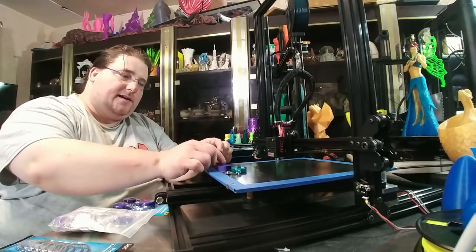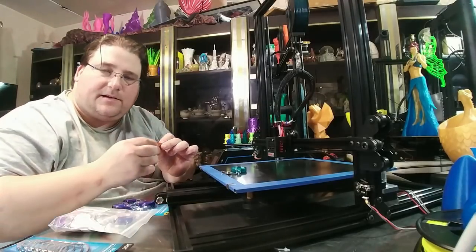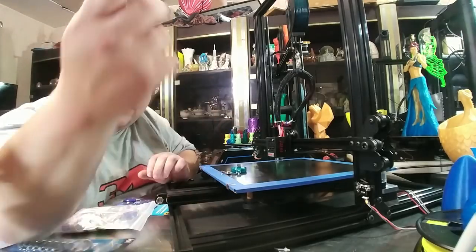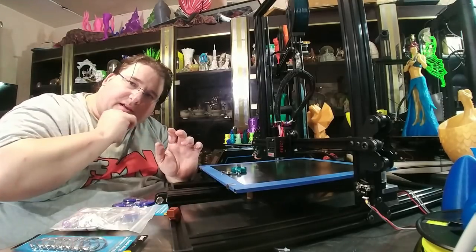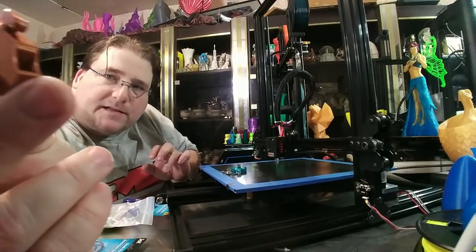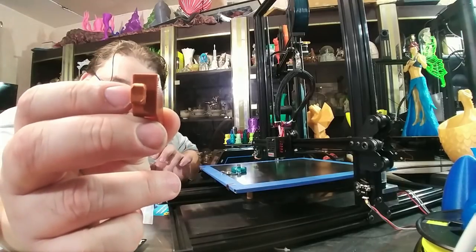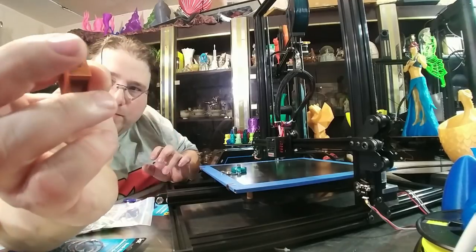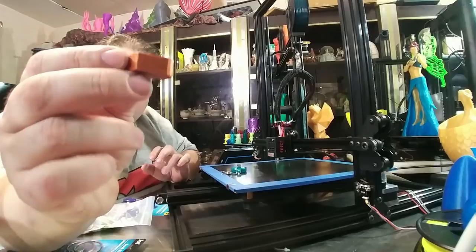I went into Tinkercad and designed a little mount for the printer. This is a little widget that snap-locks into your extrusion. You put it in the extrusion this way and turn it, and it locks into place. This is one of the older prototypes that was too tight. It looks like a hammer nut on there. When you turn it one way it goes into the extrusion, and when you turn it the other way it locks in. You want a snug fit but not a tight fit, because otherwise you will twist it off. This prints without support and without a raft — you just print it like that.